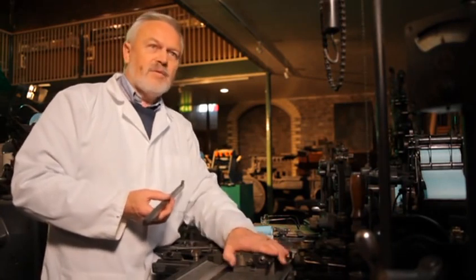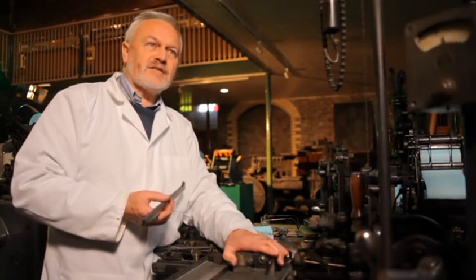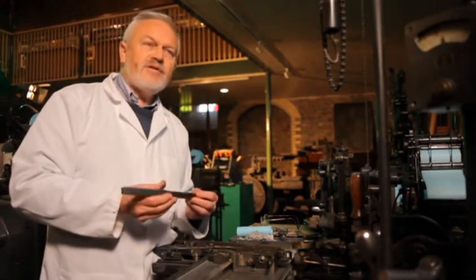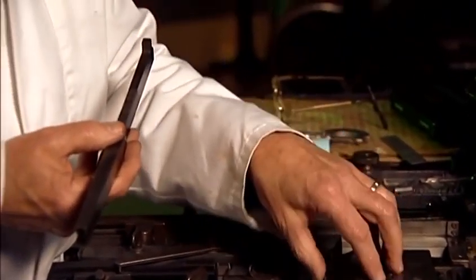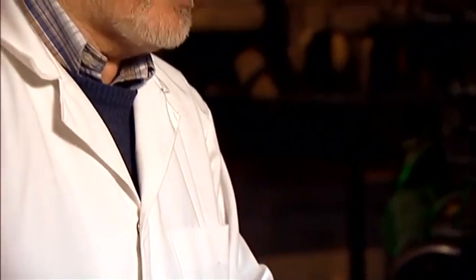A 12-point mould measures 0.166 in width. Every other point size is directly related to 0.166. It's based on that. So the maths have been done, and when the maths are done and the wedges are in place, each line will come out justified. When the lines are produced, they should come out like a piece of glass.